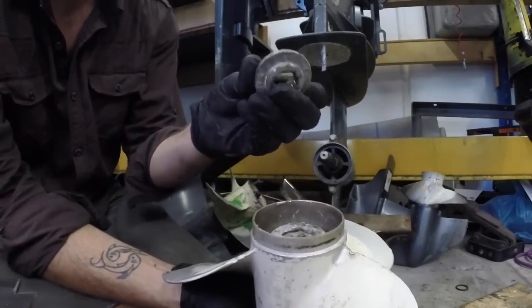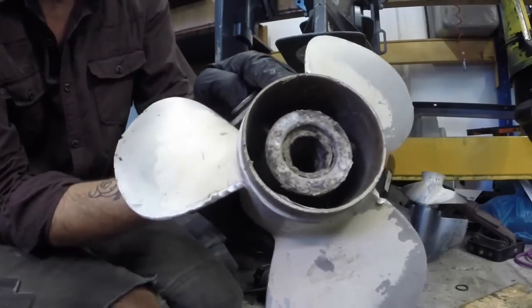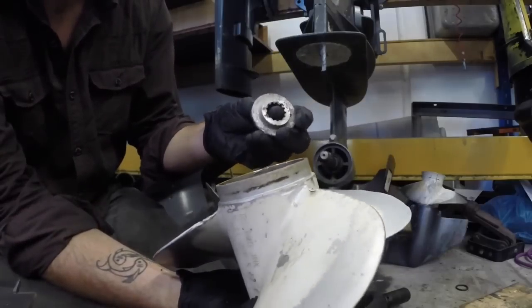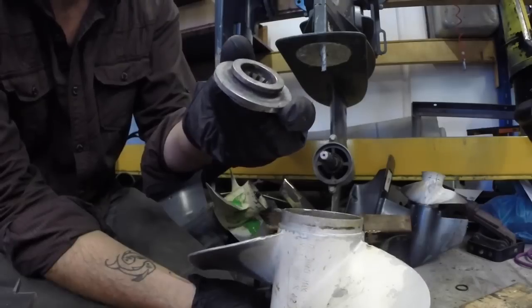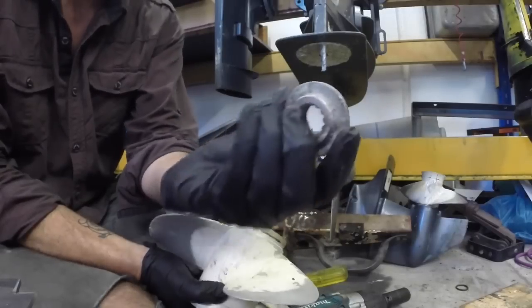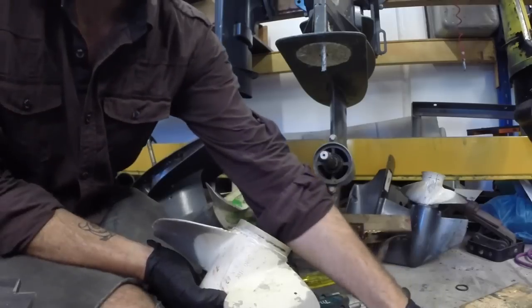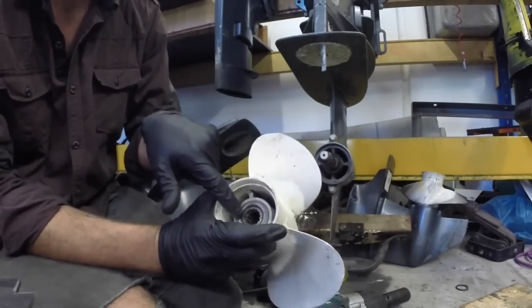Once again we want to — I'll go and clean this up, it's got a bit of corrosion. You can see the prop itself is quite corroded too, which is why it was stuck. Keep an eye on the orientation — this one goes with the little flange section towards the gearbox, laid out in order. So now we know it goes: thrust washer, prop, spacer, nut.